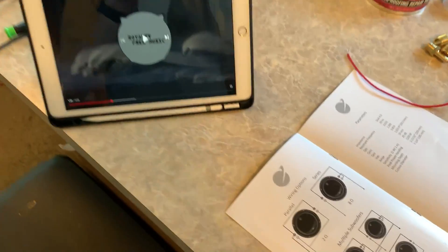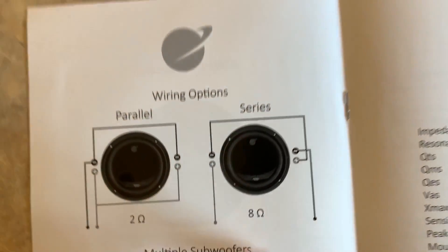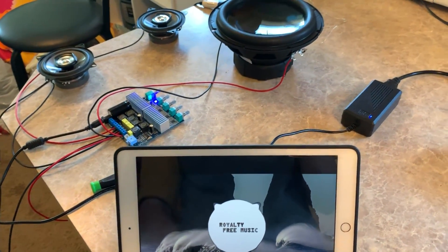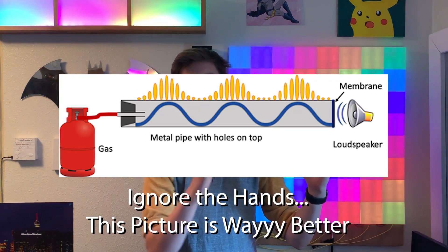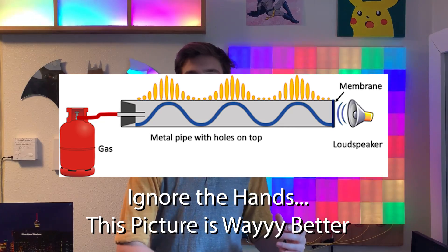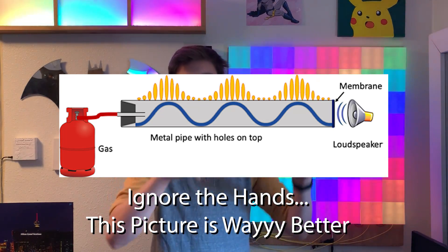Let's find out. Initially I had the wiring wrong — I had an extra wire connecting two terminals, so I removed it. After the fix, the speakers are working. Now that we know the speakers work, I can get to work on building the fire itself. To achieve the dancing flame effect, I'm building something called a Rubens tube. It's basically a metal tube with a latex end and a speaker on one end, solid on the other. The speaker vibrates the latex, causing standing waves to form inside the tube. When gas is pumped in and flames come out the top, the standing waves show in the fire. With music, the waves constantly change, so it looks like the flame is dancing.